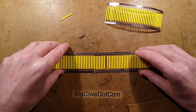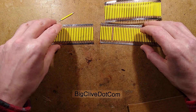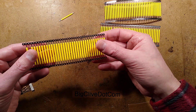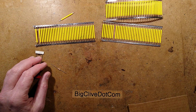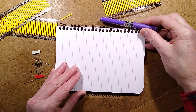So the first thing I want to do is test these. I don't know what voltage they are — I've tried them at low voltage — but I get the feeling they're the traditional mains ones that probably have about 30 LEDs in series, so about 100 volts per filament. I'll find that out with some discrete components. I shall doodle down what I'm going to do, then pause while I build it so this video isn't enormous.